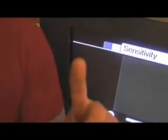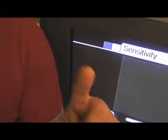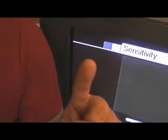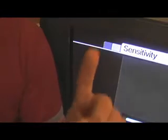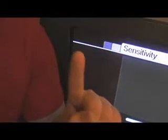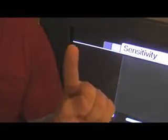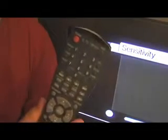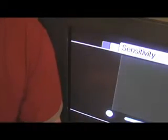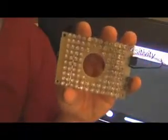Now, if your fingers are anything like mine, they don't emit very much infrared light. They're made out of skin. But what they do is that they can reflect a small amount of light. So if we do something like shine a bright remote control at it, the finger is going to reflect enough light for the Wii Remote to see it. A normal remote control is probably not going to be bright enough to do this, but what will be bright enough is an infrared LED array.